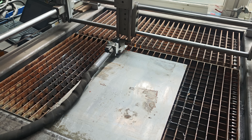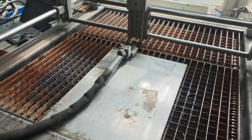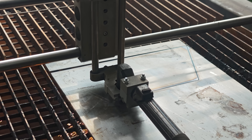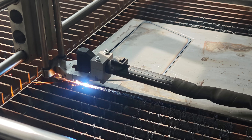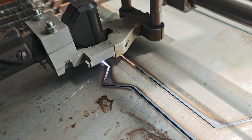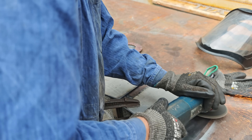The typical graphite and ceramic crucibles you can often see in metal casting are typically cylindrical or round in shape. But in order to use the available box-shaped space inside the kiln optimally, we will now make a steel pan with a rectangular footprint instead. So after taking some measurements, I drew the parts needed in a CAD program and generated a toolpath for my CNC plasma cutter to cut out the parts. The CNC plasma cutter has certainly proven to be one of the most useful machines I ever built here. Since the steel sheets I'm using are usually from scrap, there's always some rust that needs to be ground off — and since plasma cutting leaves dross or slag behind, cleanup is almost always necessary anyway.